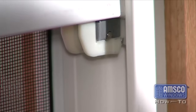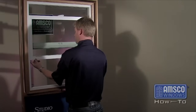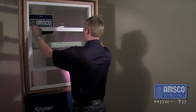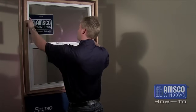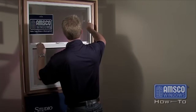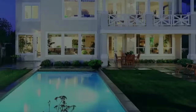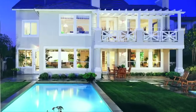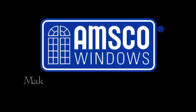Check that the bottom of the spring is not exposed under the window. It may be necessary to reseat the sash on the balance springs if not properly seated. To reseat, slightly lift up the sash with the balance springs engaged in the take-out clips. Once the sash is properly seated on the balance springs, close the sash and press in the take-out clips. You have now completed the replacement of your balance spring. Make your home a masterpiece, AMSCO Windows.